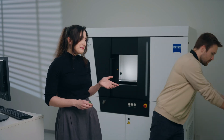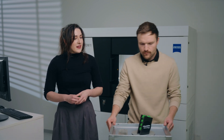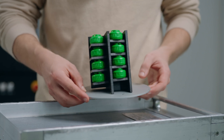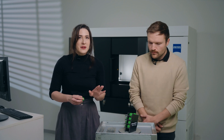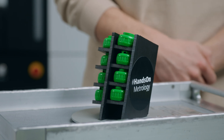Here's a fixture John made earlier. If we take a look at the fixture used today, you will notice that we have built our fixture to have small foam barriers between each part to avoid contact. You will also notice each part has been placed at the same 15 to 25 degree angle recommended in our earlier fixturing video. If you fixture your parts as close to the center of the measuring area as possible, this will improve your overall scan times.